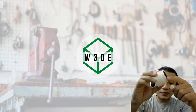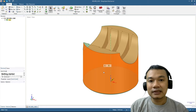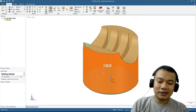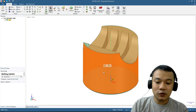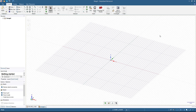This is how the design of the inner part will look. It has an outer diameter which should be less than the inner diameter of your container. You need to measure the inner diameter of your container and then reduce it by about 1 millimeter, so you will have allowance to insert the inner part. Let's say your container has an inner diameter of 40 millimeters.